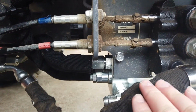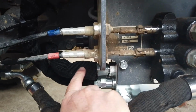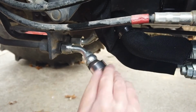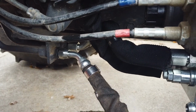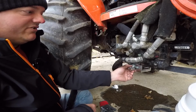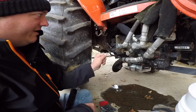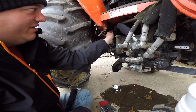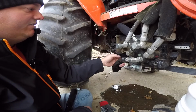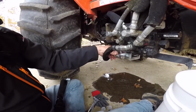And then our short 11 inch hose is running from the solenoid back to the original one we took off here on the back of the tractor. This one is still the factory OEM line that is on here. Our next line is going to run from the outside 90 that's on your solenoid, and it's going to run up here to this fitting that's on the tank, or goes to the tank. This actually had a cap on it, so we're just going to pull the cap off and then run it to this 90 fitting out here on the solenoid.